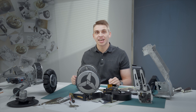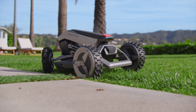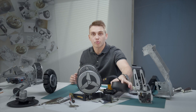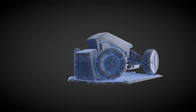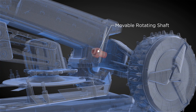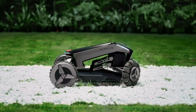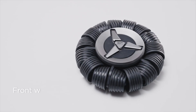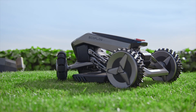The wheels on the Blade are very eye-catching. The radius of the rear wheel is relatively large, mainly to ensure its ability to climb obstacles. The tread on the wheel increases friction, especially on grass terrain. Blade is a rear-wheel drive robot and, unlike many others, it doesn't use a step gearbox — both rear wheels are high-torque brushless motors that output 10 Nm of torque each. A movable rotating shaft is added at the junction of the frame and rear axle, with a maximum inclination angle of 27 degrees, ensuring all four wheels touch the ground at the same time on uneven surfaces. The front wheels are 200mm diameter omnidirectional wheels composed of multiple smaller rollers that rotate freely, reducing friction and resistance when turning — acting like a zero-turn mower.